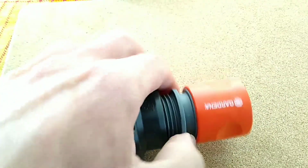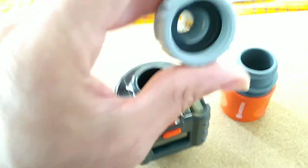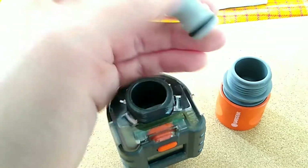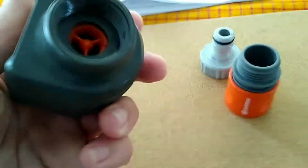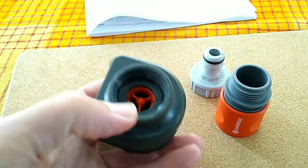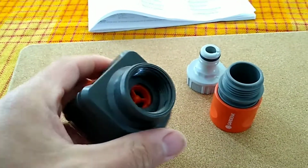And I would also suggest that anyone who has problems with the unit leaking should check that those connectors are screwed on tightly. There are rubber washers inside both that end and inside the body at the other end. Later I'll show you how to get the impeller out, which, I forgot to tell you at that stage, involves taking that rubber washer out.